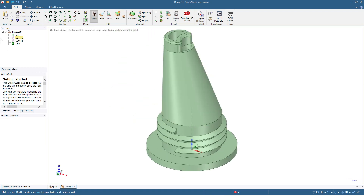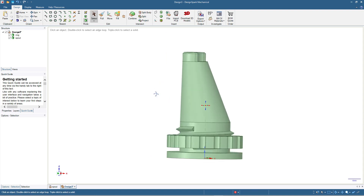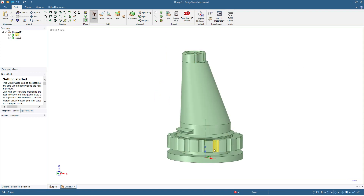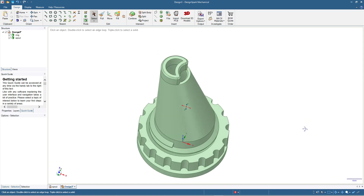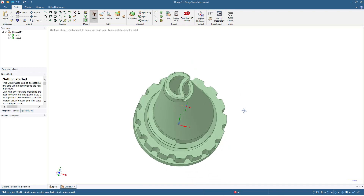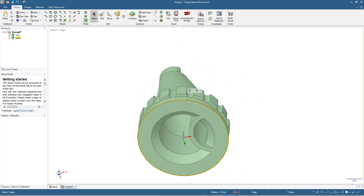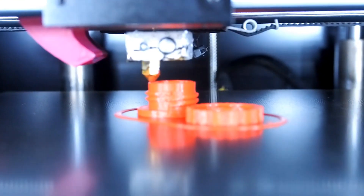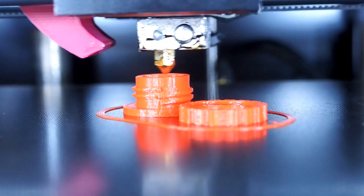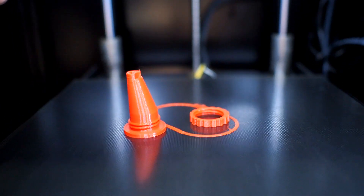Show the base portion of the spout and combine these two: select both and click combine. Let me add another chamfer here — press Ctrl, click these two curves, pull, chamfer, 2 millimeters. So this is the design of the spout and the ring. You can export the design one by one — the ring as one part and the spout as one part — and print together. You don't need any support for this design. The flange is 12 millimeters radius or 24 millimeters in diameter. I'll post the STL and DesignSpark Mechanical file on Cults 3D — find the link in the video description. If you like this content, don't forget to like, subscribe, and see you in the next video. Have a great day, bye!